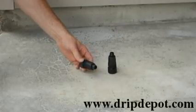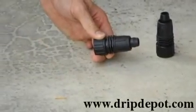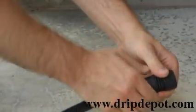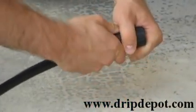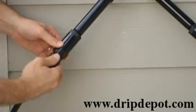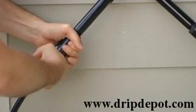The last item is the hose swivel adapter. To use it, screw the locking nut back to expose the barb, push your tubing over the barb, then screw the locking nut forward to lock the tubing into place. Now connect the hose swivel adapter directly to the pressure regulator. This kit comes with a permalock hose swivel adapter, which is reusable.